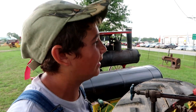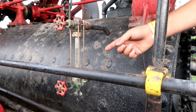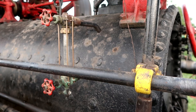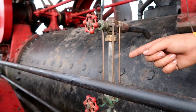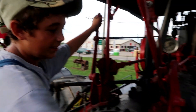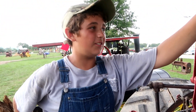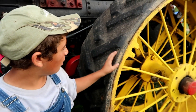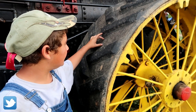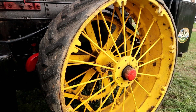This is actually a two man job because it takes a lot of work to get the wood and keep up pressure and watch your water level. This is a water glass. If that runs down, you need to inject some water — this just pulls it out of the tank or the steam will pull it into the boiler. You always want to make sure you have water in this water glass. And then just running and steering the engine, because these don't have power steering — it takes a lot to move it. It's moved by a worm gear. Originally whenever this engine was built, it wouldn't have had this rubber cap tire around it. It would have actually had metal little pieces that would go in the ground, but they put this on here just because they kept breaking off and this won't tear up as bad.